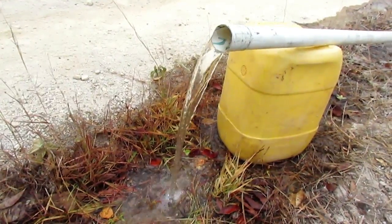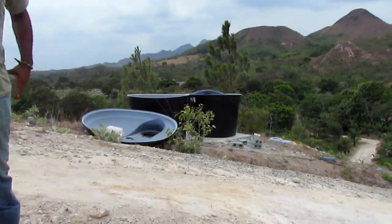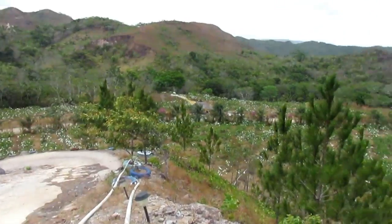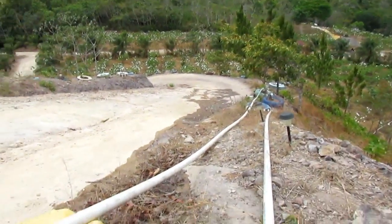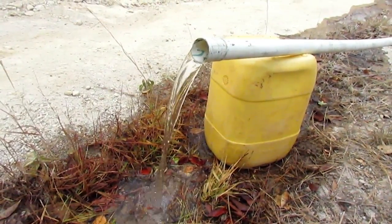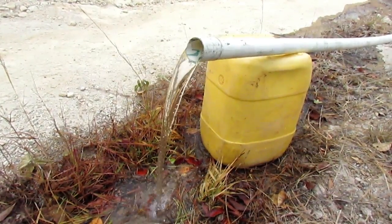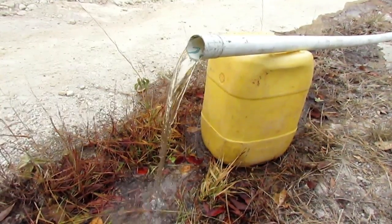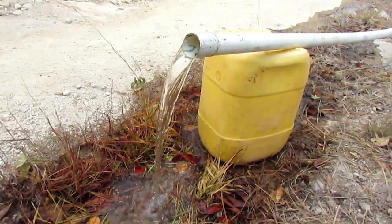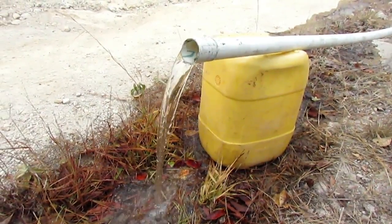Here at Visión Verde we have just measured the water at the top of the hill. Just across from us are the reserve tanks we will be putting water into, so we are at the level of the top of these tanks, pumping from way down in the stream. We filled a 5-gallon or 20-liter jug in 1 minute and 20 seconds. Doing the math, that is 21,600 liters in 24 hours — we had projected 20,500 liters, so we are delivering more water than what the chart says and what we had implied to the client.